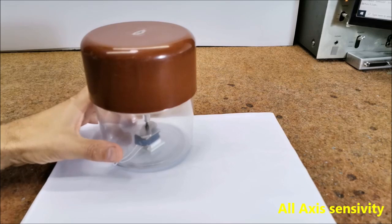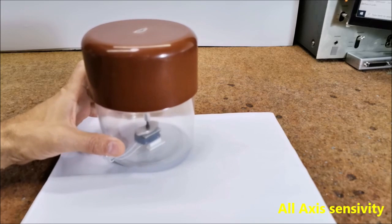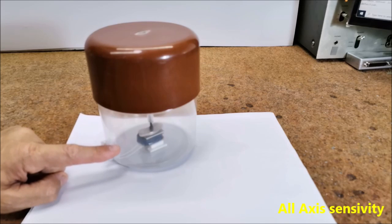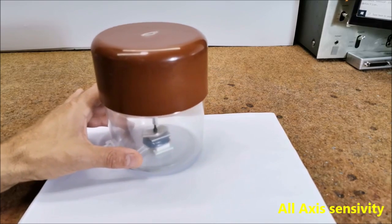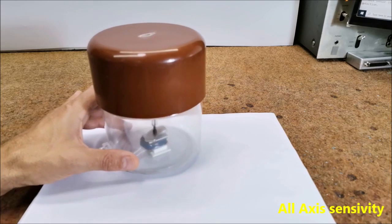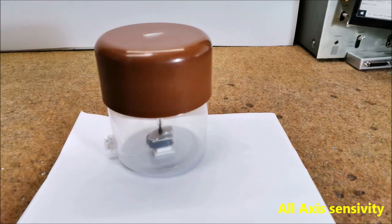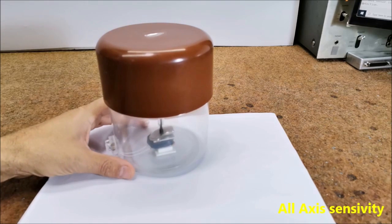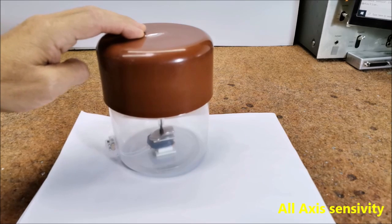As you can see, the sensor is sensitive to shocks from all directions and axes. During vertical shocks, the spring reacts, and during horizontal movement the pendulum can move in all directions — 360 degrees. Such sensors that respond in all axes are very expensive and used only for professional purposes. This DIY geophone can be mounted on the ground using spikes or other mechanisms to ensure good contact with the earth's surface, and in some cases geophones are buried at varying depths.